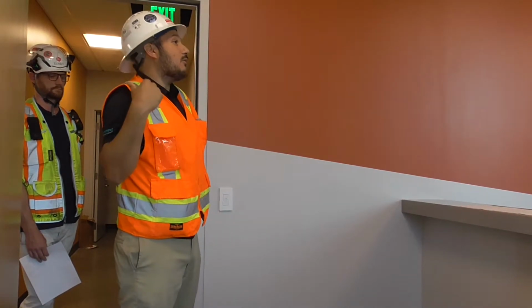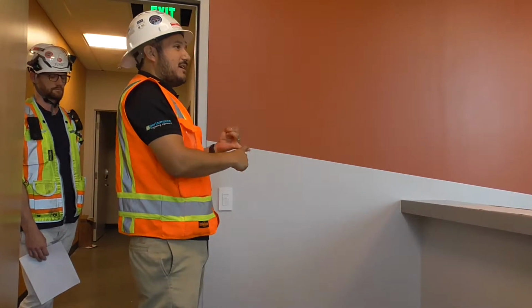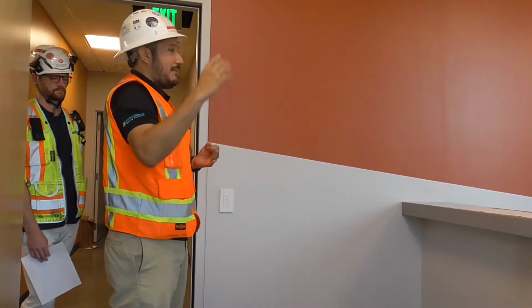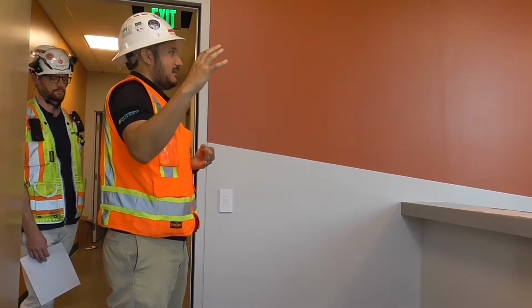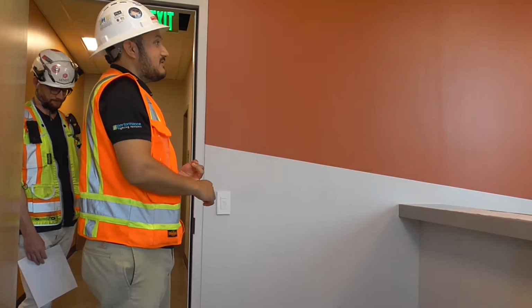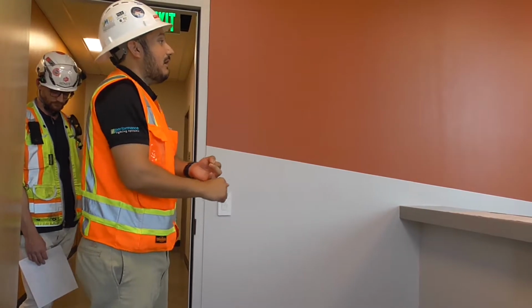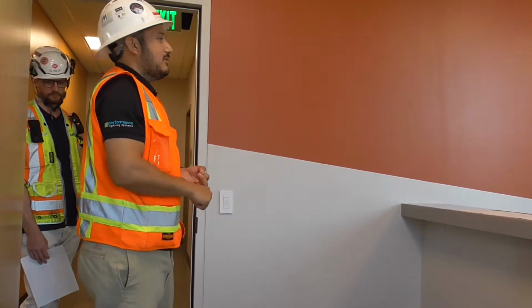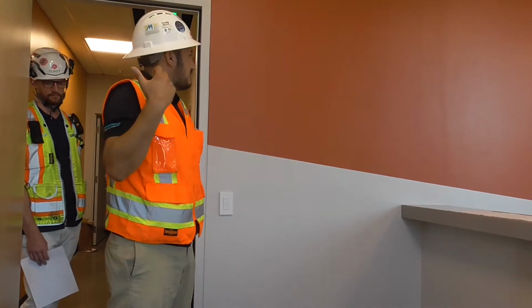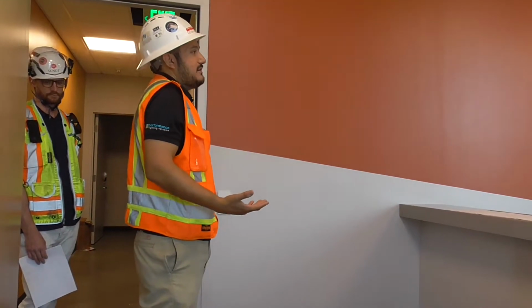Now, if we go to a small office behind us and disconnect that run from the bridge, that room is still going to work. The reason is that the switch and that power pack are tied in with Cat 5, and that power pack is still energized, so you still have control from your switch, everything will turn on and off, and your sensor is still going to talk to that pack to tell it to turn on and off. All you're going to lose is the communication over the main network. But that room will still work. No one will know anything different.